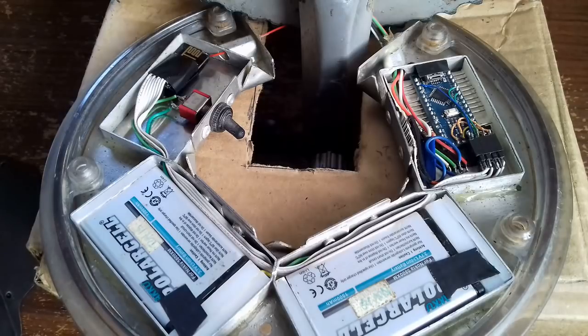It works very well most of the time, apart from on really steep hills. I think it's to do with the fact that the weight on the pedals perhaps doesn't drop enough to finish one rotation as far as the code is concerned, and start the next rising edge. So occasionally you get a big spike in power, but it doesn't happen that often.